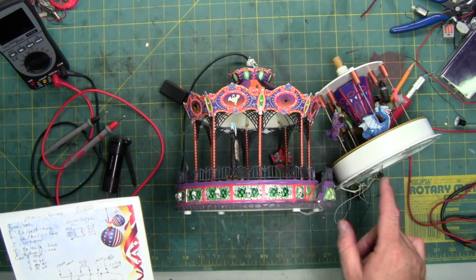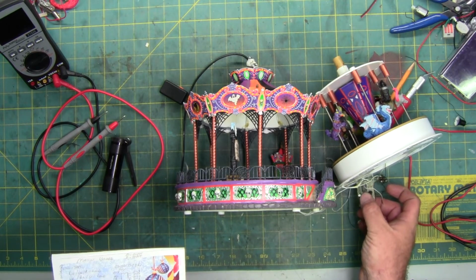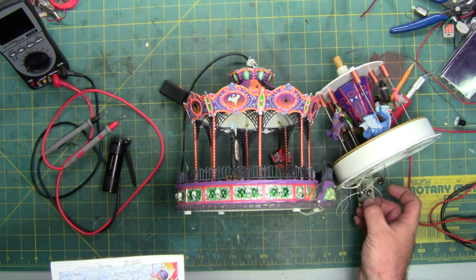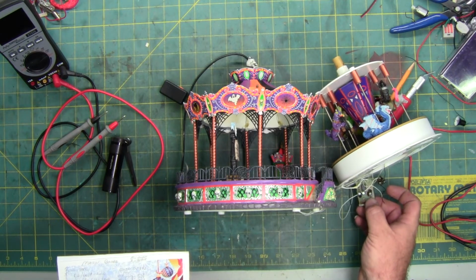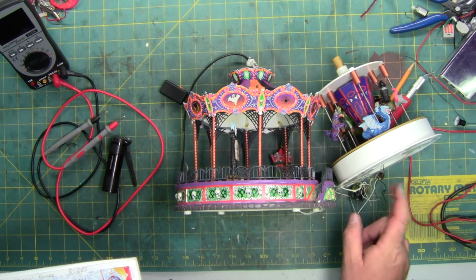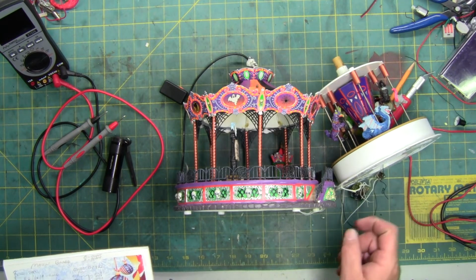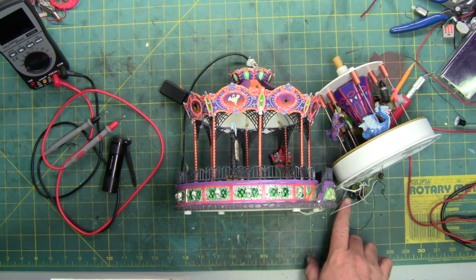So anyhow, the capacitors are on here. There's 4. There's 3 bigger capacitors right there. You can see the shine of the tops. Then a little small ceramic one in between. Of the 3 capacitors, 2 of the taller ones here are 10 microfarad. Third one's 100 microfarad.